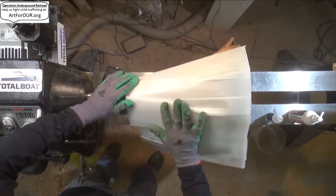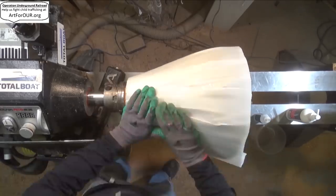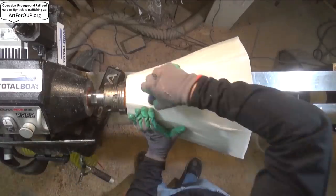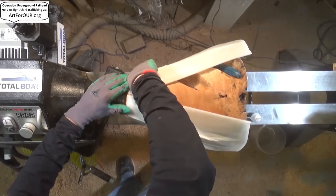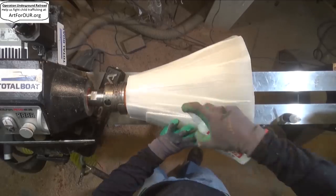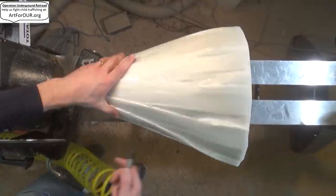And then I cut these fins through the layer, which allows me to overlap them and glue them down and take the shape of the project. The idea here is, of course, to minimize the amount of resin that's lost. So once I do this, put it in garbage bags and pack sand around it, it makes for almost a perfectly tight form that's customized every time.